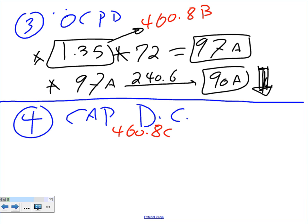And can you guys also put CSK here? Because that's also opinion. Opinion is worth what you pay for it, right? It's free. So if you go to a different company and they say, no, we're going to size it based on 100%, you size 100%. Because the code is not clear on it. As small as you can. You can size it 5 amps if you want.